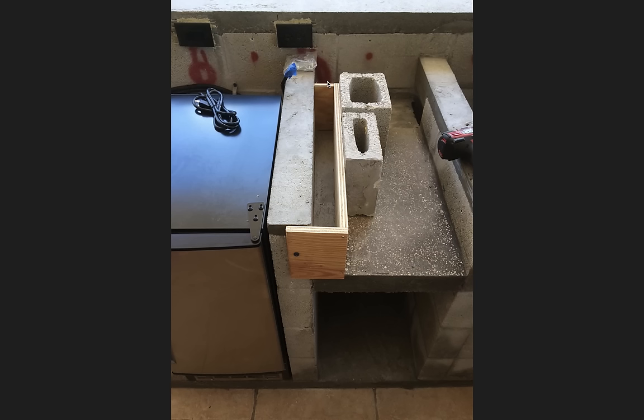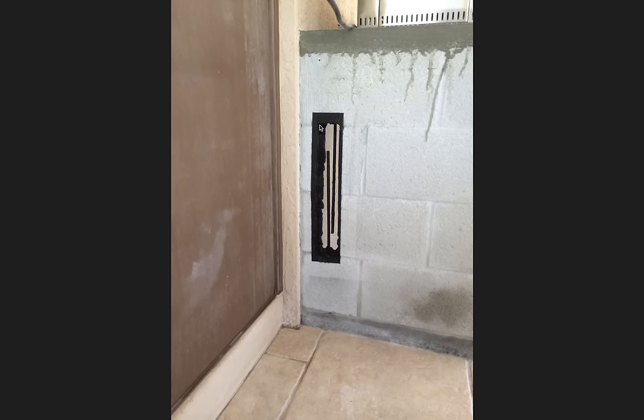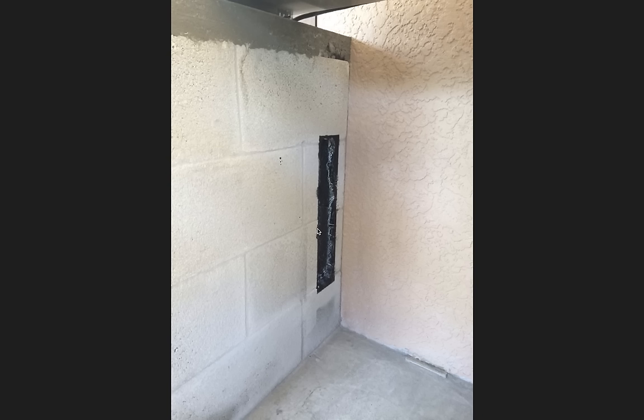I realized that I needed a vent behind the refrigerator, so I had to cut through the concrete in order to fit the vent in. It has to be one inch on the bottom, one inch on the sides, and one inch on the back, all the way around. I painted the inside of this hole that I cut. You can see here's where the rebar is — solid concrete. The only reason why I didn't cut these off is I couldn't get the grinder in there. But I painted it black so that when you looked through the vents, you couldn't see anything.